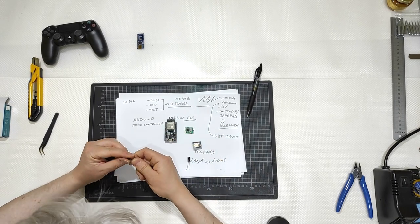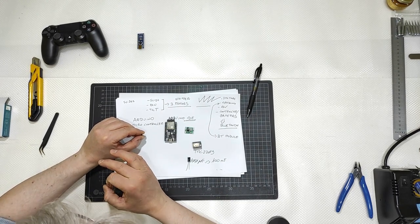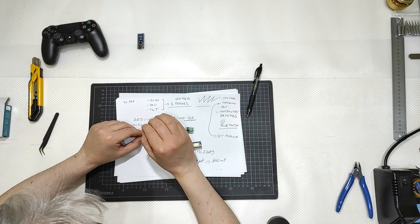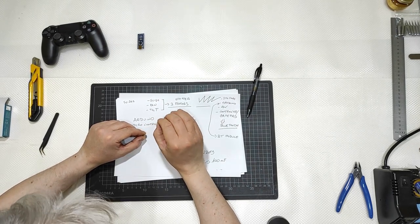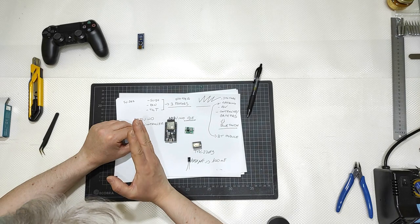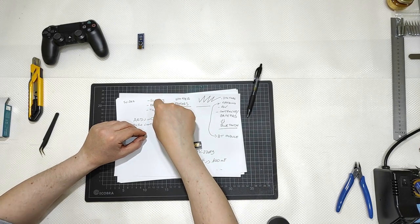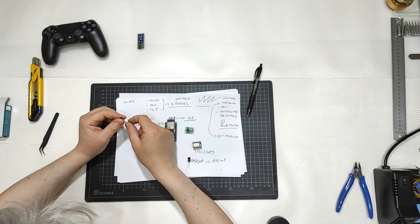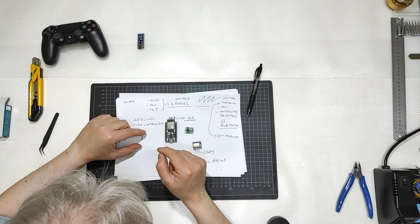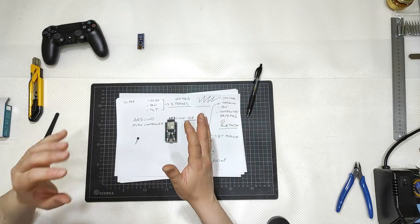It is used, as I explained, to find the zero point of the slide, pan and tilt. So the zero point in degrees of the home point. The slide, pan and tilt can have a known point. Starting from that, you know that this is the zero point and you start moving for the slider, or you start rotating for the pan and tilt. So everyone uses this. Why not integrate them? But I also explained to you that I will never use them because I don't need them the way I programmed the system.